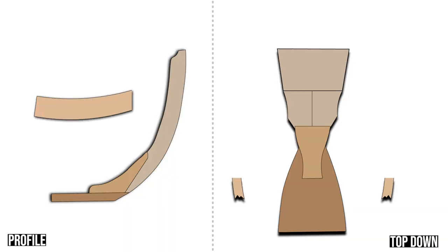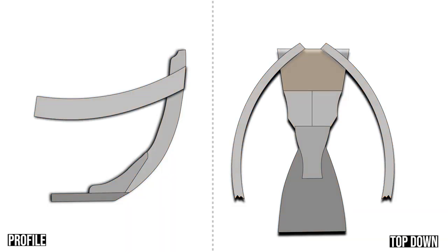So why do we need to bevel the stem, and why devote a whole episode to detailing this process? As we explained in episode 11, we have to bevel the stem in order to accommodate the angle at which the planks are hitting the stem. Now just like the bevel on the keel, the bevel on the stem — which can be considered a continuation of that same bevel — is not uniform. It changes continuously as we move from the base of the stem to the top of the stem. And this, you'll remember, we call a rolling bevel.